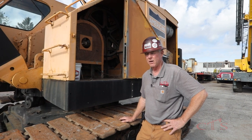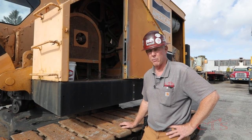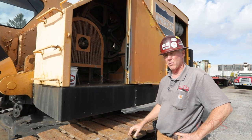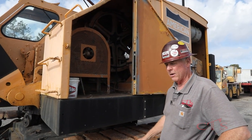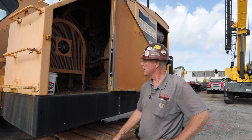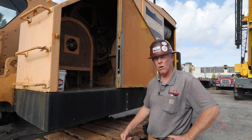I have to release my brake, and then when I release my brake, I'm in free-fall mode. The load will come down until the operator applies his brake again. We have two bands here - an inner band and an outer band. When the operator applies the hoist, the inner band applies and the load goes up. When he releases the hoist engagement, he has to apply his brake with the outer shoes, because then it will hold it.